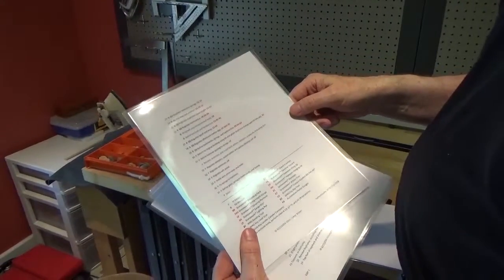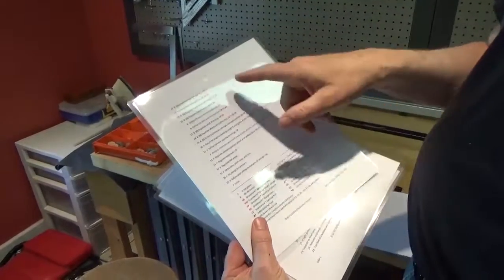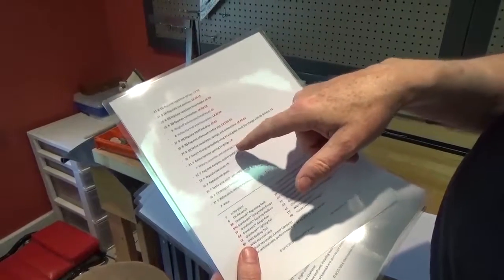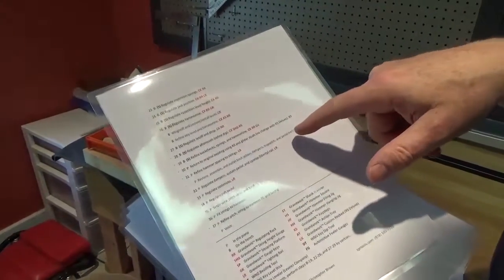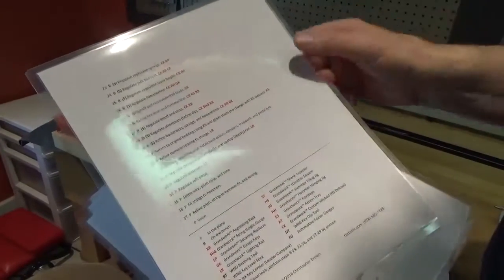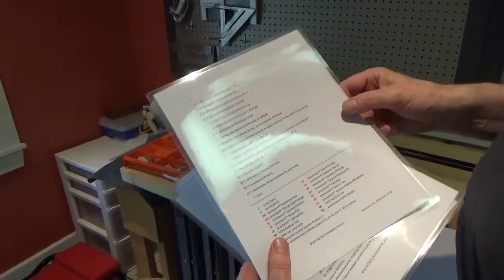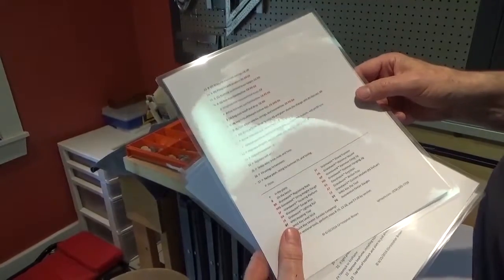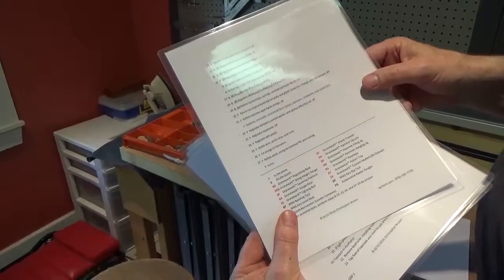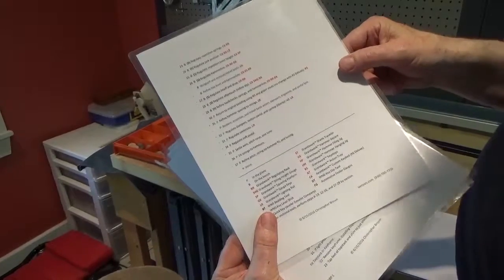teaching regulation. And it's a bit of a contrivance to push and pull them so they come out at just 37. And one of those contrivances is that I leave out the things that you might not do, like restoration, assemble, install the back actions, and so forth. And the voicing is kind of a thing of its own. In fact, this regulation protocol is really a pre-voicing protocol. It prepares the piano to realize the potential that's in the voice that the action carries for the performer.